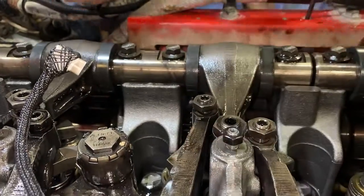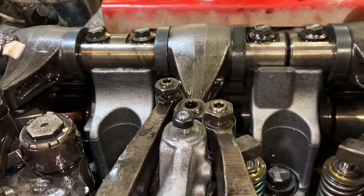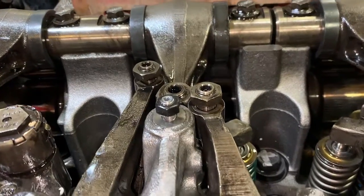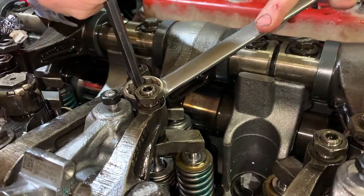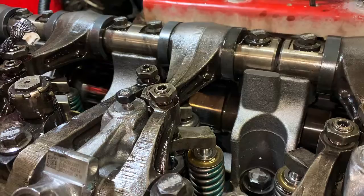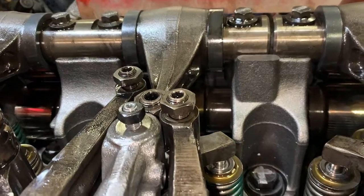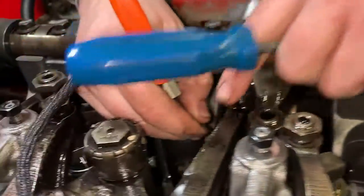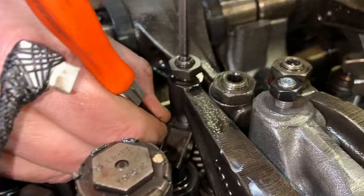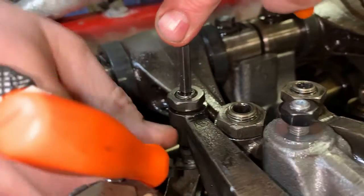He's setting cylinder number 4 right now, so the next is going to be number 1. And he just torqued the injector. On this particular engine CPL, that is torqued to 70 inch pounds. It doesn't matter that we use the click-type torque wrench — you don't need a dial on this because you're seating the injector down, and so the click-type wrench works just fine as long as you're careful with it. Now that the injector is set, we're going to set the valves next. It doesn't matter if you set the injector first or last because it's on a separate shaft — it's not pre-loading anything, it's not lifting the shaft up. So you can set these in any order you want.